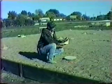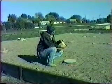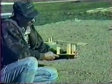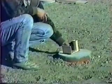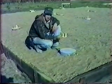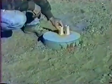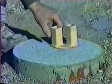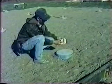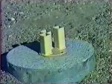This pin cluster fastens the end wall to the front and serves as a sliding door guide. There are 4 of these, 2 right and 2 left, per building. The 2-way pin clusters go at the bottom 4 corners of the building, connecting the back wall to the end walls. Three-way pin clusters fasten 2 backs or 2 fronts to a divider at the bottom.